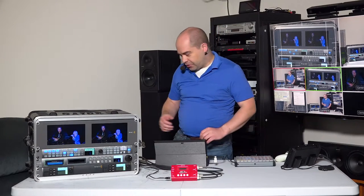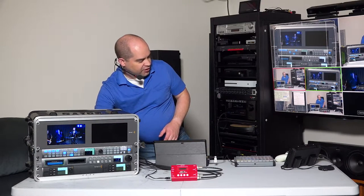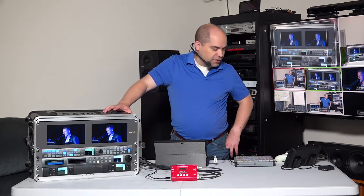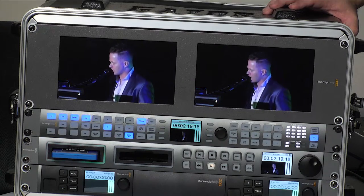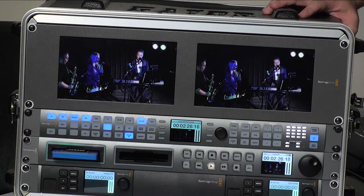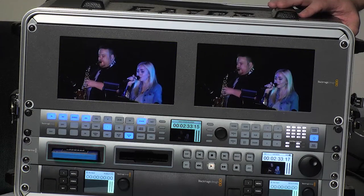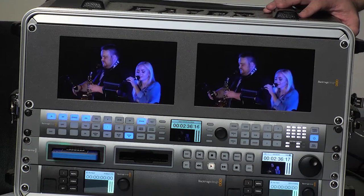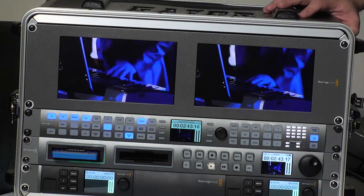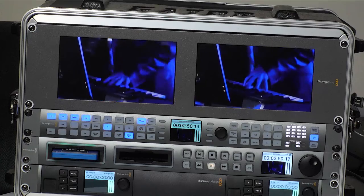I'm going to rewire my panel and switch the second LCD to the output of the Teranex, which is currently converting the same HyperDeck video on loop. One thing you'll immediately notice is that there's quite a bit more delay on the Teranex than on the Decimator unit — it's actually a perceptible delay. It's long enough that I've elected not to ever use the Teranex in a live situation, particularly where the video being switched is shown on a projector in the same room as it's being shot, because it would be very easy for someone to spot the processing delay.